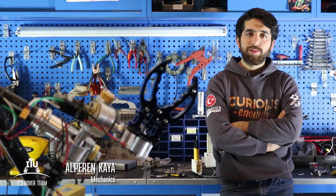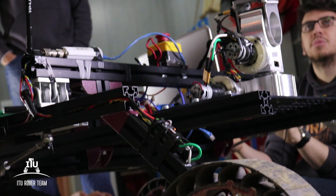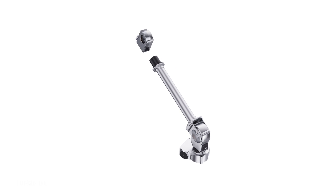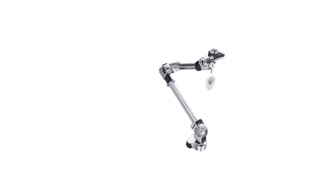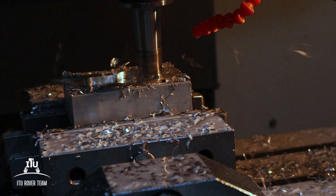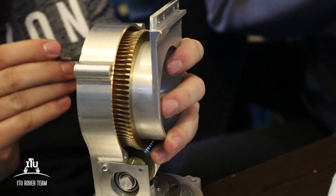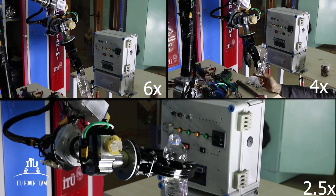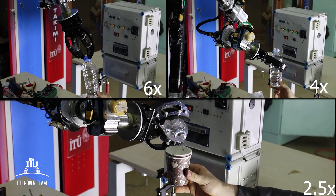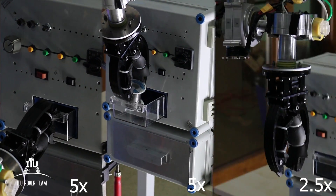Our 6-axis robotic arm was inspired by the human arm. Its range is 130 cm and it can lift up to 5 kg of payload. Each axis has an aluminum housing consisting of a worm gear mechanism driven by a brushed DC motor, and these housings with carbon fiber tubes form the structure of the arm. At each joint, worm gear mechanisms are also used to prevent back drive, reducing motor load while increasing torque output. According to our experience, a 2-finger gripper provides better view during operation, with handling improved by rubber inside the fingers. The gripper can also handle mission-specific end effectors.